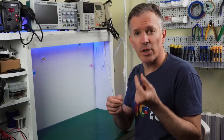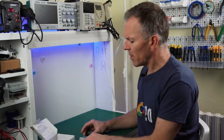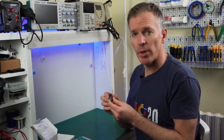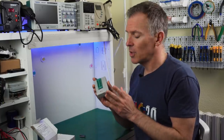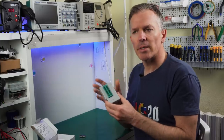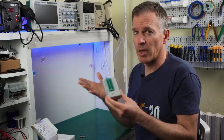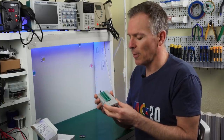Some of you asked if I had tried reading the ROM by some other means, because it could be that the ROM was fine and the problem was the single-wipe socket instead. To be fair, those MOS ROMs tend to fail a lot, but it was definitely a valid question, and no, I had not tried reading it back. But I figured today is a perfect time to give it a try. So I took out my regular EEPROM programmer, and it turns out that the equivalent EEPROM for this is a 2364. I went to look at it in the supported EEPROMs, and it wasn't there. The 2364 requires higher voltages than this programmer can provide, but I would have expected it to be able to read it back, because you can read it back without any weird voltages at all. So that was kind of surprising.